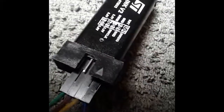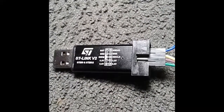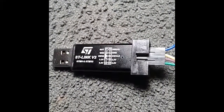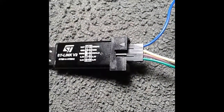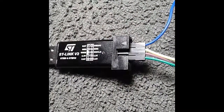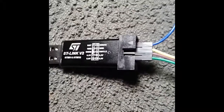Then they go into — here's the labeling on the USB drive — Ground and SWDIO, SWCLK, 3.3 volt. I got the green to the 3.3, the purple to the SWCLK, the yellow to Ground, and the blue to the SWDIO. And that's my 99-cent solder gun — good to go.